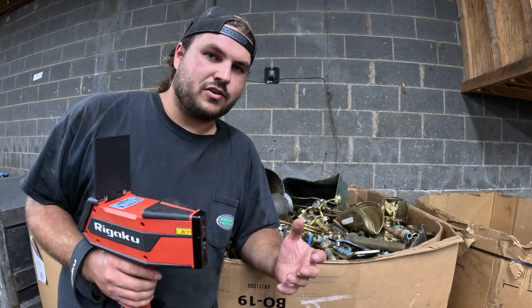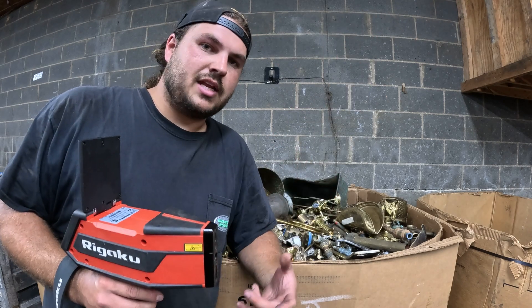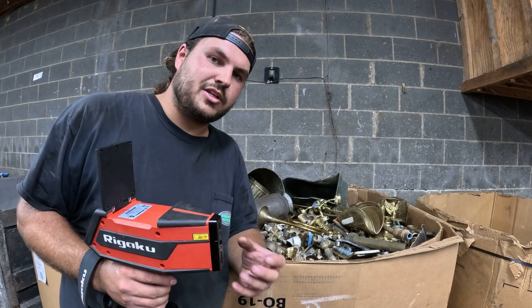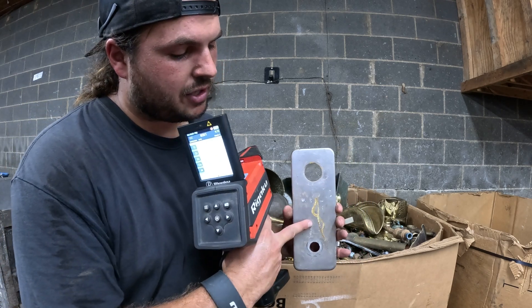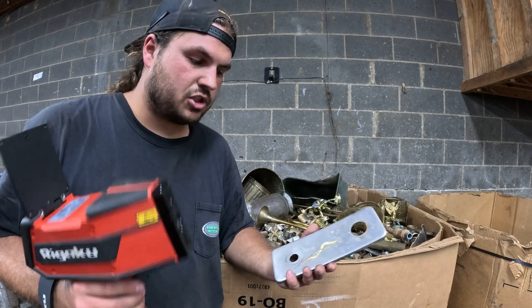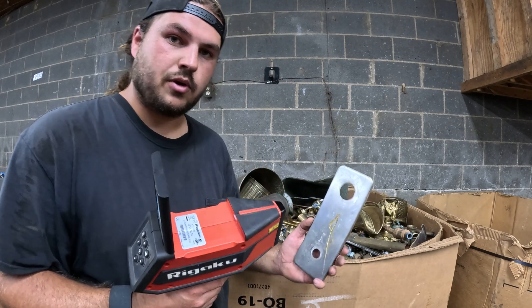These analyzers are very versatile — we can use them on all different types of materials. We've done stainless steel and several types of aluminum, but we can even do copper and copper alloys. I'm standing in front of our brass box, but I wanted to show the importance of not shooting a material that has a coating on it. I've got this piece here where you can see it's been hit with a grinder — it's definitely yellow brass underneath, but it's coated, probably with nickel. Sometimes you'll have tin-plated or silver-plated pieces. Let's shoot the outside and see what the coating reads as, then shoot the yellow part and compare.